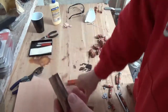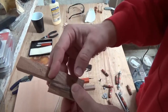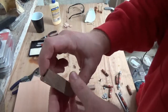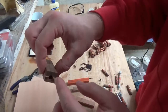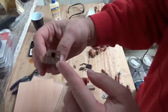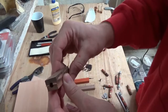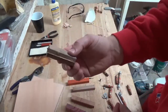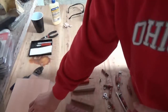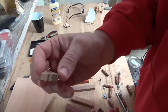The next step: they're originally going to be this long, but you're going to want to cut the blank in half or thirds — however long your drill bit is for your insert. Then you're going to drill through the center of the pen blank with the seam and veneer running through it. Once you have a bunch of these created in all different colors, you want to cut them into little tiny segments, probably about a quarter to a half inch thick.